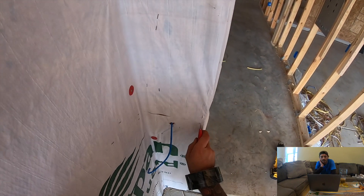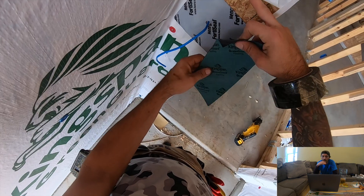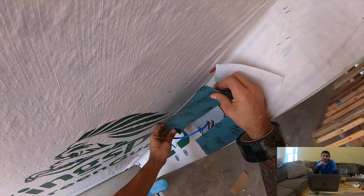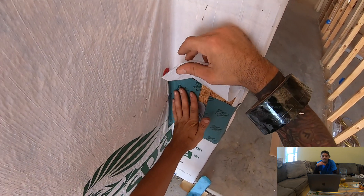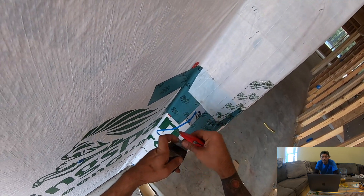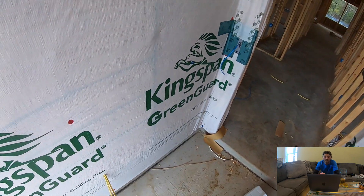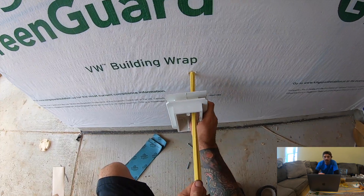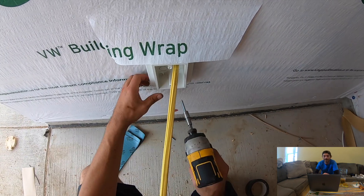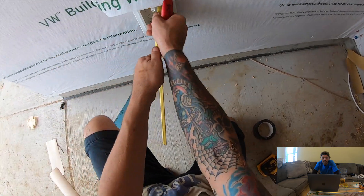The doorbell is going to be a little tighter — you might not be able to get those angled side cuts perfect, but it's mostly the effort that matters. A lot of builders want the doorbell button in the door trim, but the reason I have it off the trim is this builder installs Ring doorbell kits for every house. You want it a little bit high so the camera is at chest-to-head height rather than looking up at someone. Make sure this box is straight because once it's there it's there forever — cut it in.